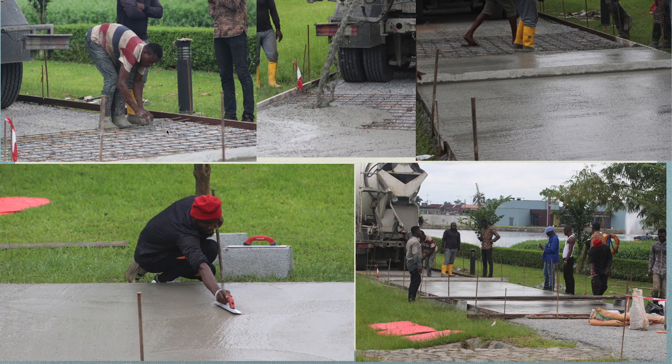It is very important to suspend your rebars with concrete cubes, as shown in this picture, so that concrete can go underneath and sandwich the rebar like butter in the middle of bread. In this picture you can see the man using the magnesium float to smooth the concrete, with the formwork in place and reinforcement visible. Concrete is a mixture of sand, cement, granite stones, and water. When it hardens it becomes a permanent feature — difficult to break, difficult to remove, and it doesn't wear out when properly done.